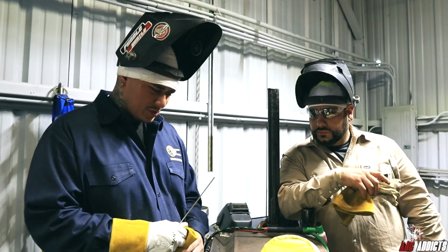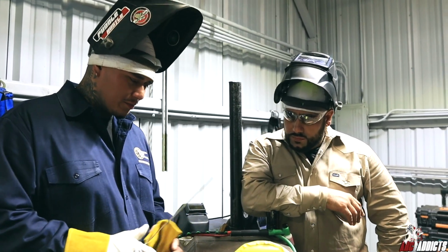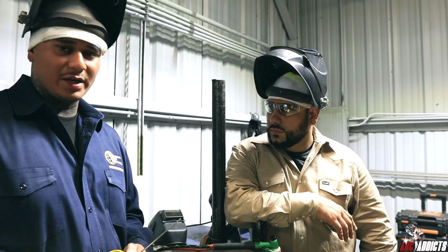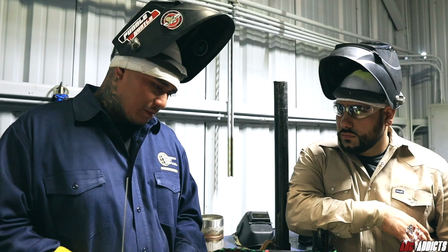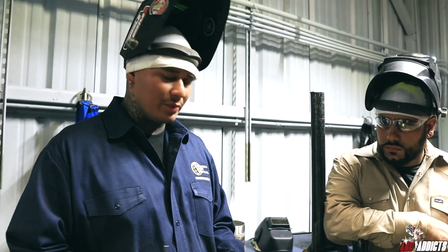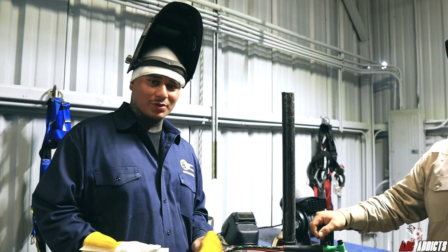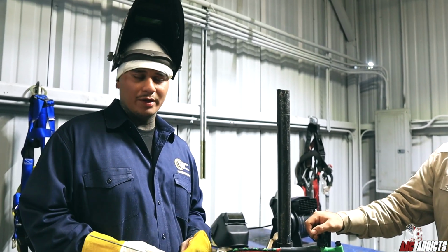Since it's just a small area of pipe right here, you don't really need much, maybe a couple minutes. But when you're on the job site, you have long pipes, and sometimes it can take up to 10 minutes, 15 minutes, some even half an hour. I've been at jobs where I've been welding 72-inch stainless. We purge it for an hour or 2 sometimes.